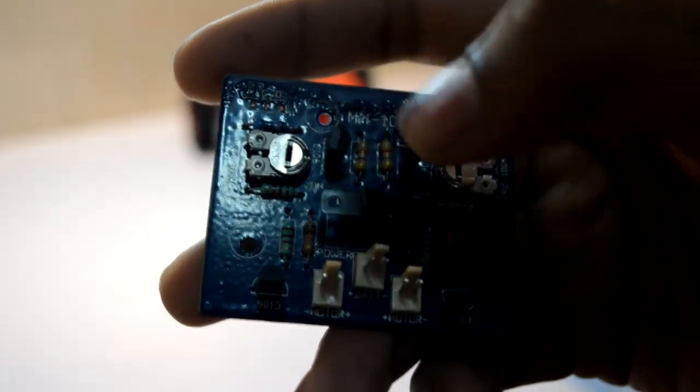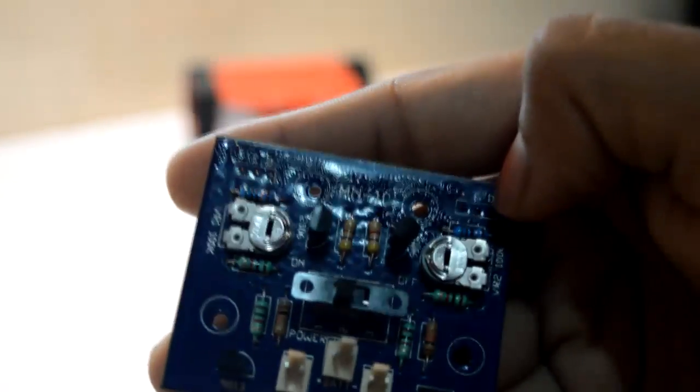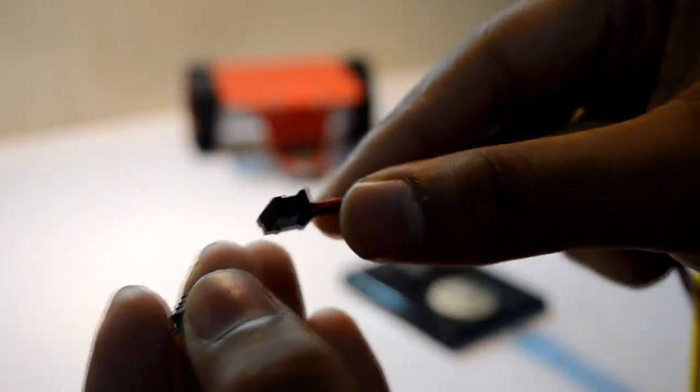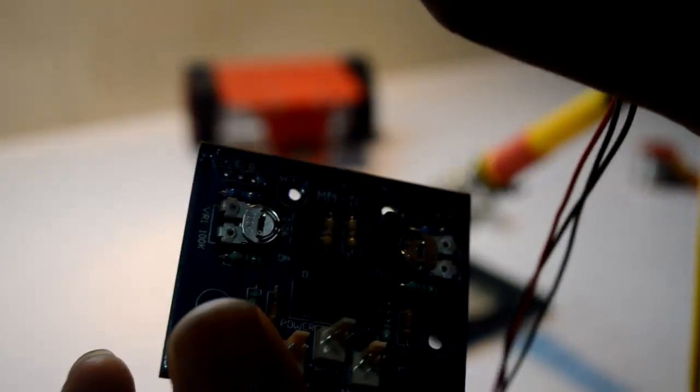This is a 2-pin connector for our motor and the battery — we'll solder them. I have also soldered the terminals for our motors, and the center one is for the battery. What remains on the whole circuit is the 2 sensor terminals — this is the left one and this is the right one. There are 3 holes: the leftmost hole is for positive, the center hole is for data, and the rightmost is for ground. The sensor has 3 cables with a male and female plug that attach in only one way — it's not possible to insert them the wrong way around. Make sure you are soldering with positive on the leftmost side.